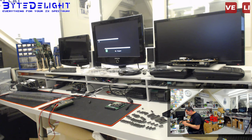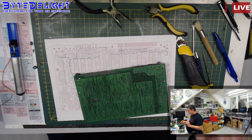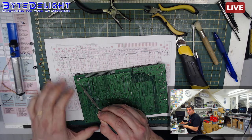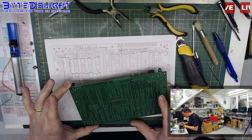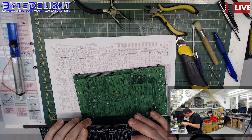I soldered it out and in a couple of times, so I'm just noticing now, let me show you what I mean. So this point here doesn't seem to be soldered that well, so the ingoing pin, the 9 volt pin. And I do wonder, by the way, how it's routed to the 9 volt pin on the edge connector. Well, let me check.